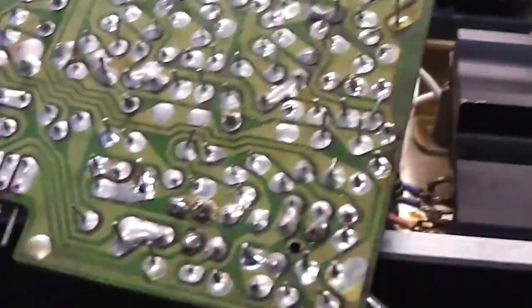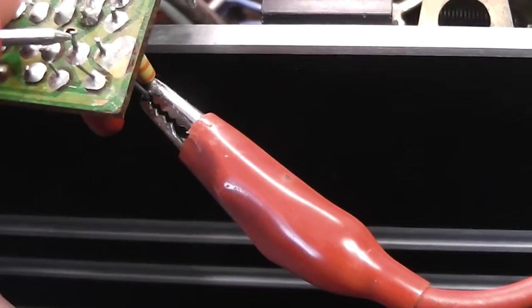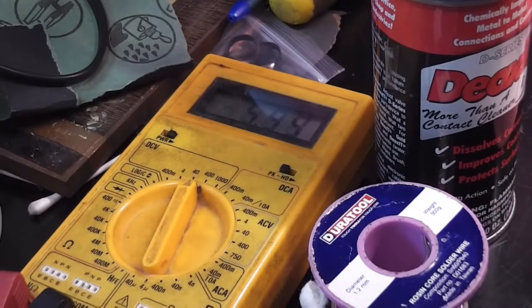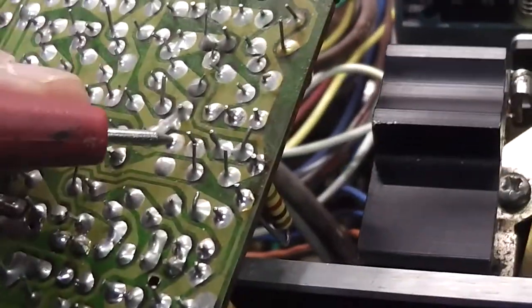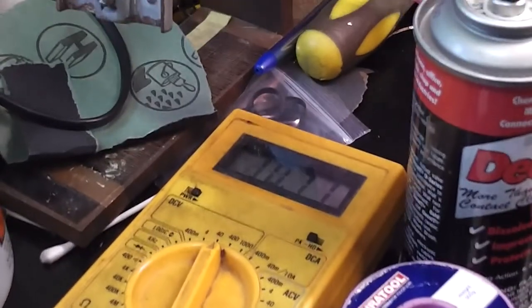I've decided to just put external power into the amplifier board and look at the decoupling capacitor where the preamp is. I've got six volts, which is a bit mysterious - when the board was in, I was actually getting no power. Probing at the power for the microphone line amplifier there's about 10 volts there. That's odd - so why isn't this being powered up while it's in the unit?